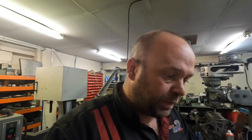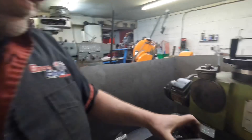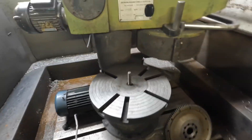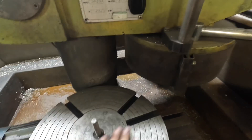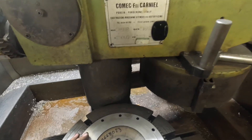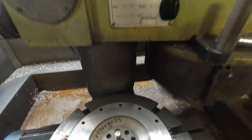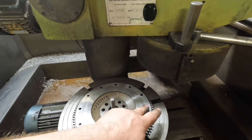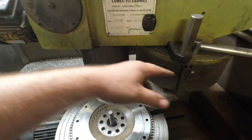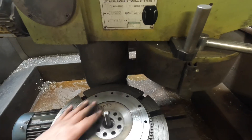The first thing I'm going to do is machine the actual clutch face, because with the heat that goes through it, it ends up being quite hard. I don't do that on the lathe — I do that on my rotary table on my surface grinder, which is here. I've just lifted the flywheel up and put it on the surface grinder. I'm going to bolt it down, clamp it, and centralize it. I can use these marks to get it pretty close. It doesn't need to be absolutely spot on because as this rotates, the machine will grind it flat and do a good job.